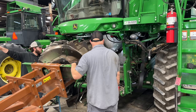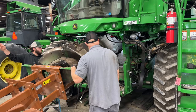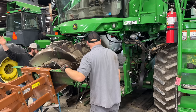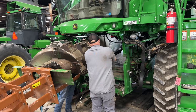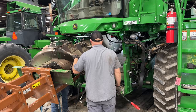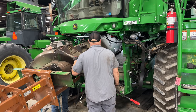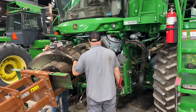And this rotor weighs 870 pounds. So when we initially took those nuts out that was holding that rotor in place with that bracket, we had to compensate with the forklift for the flex that was happening as the weight was pushing down on the lifting tool and the bracket. So we had to compensate for all the weight that the rotor has.